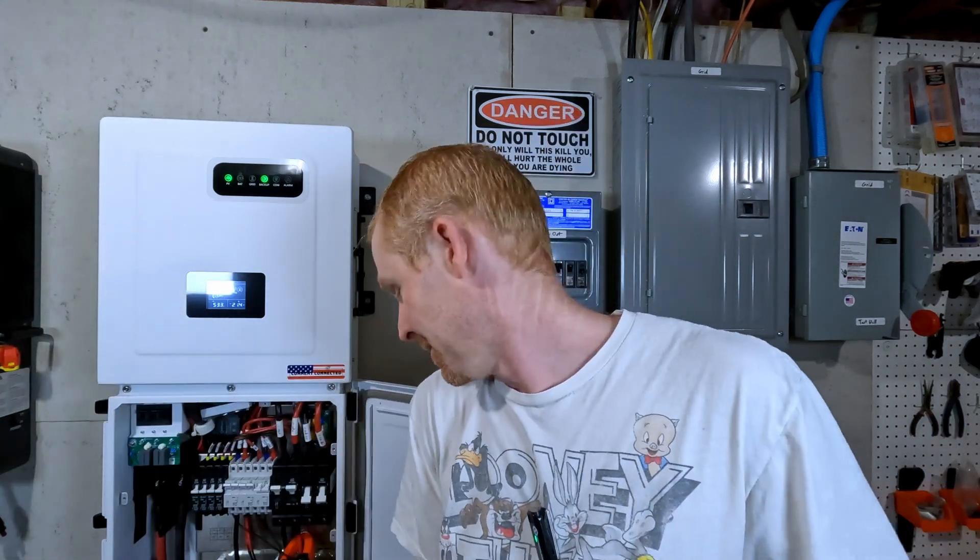I want to try and see how long it can run that way — 4 kilowatts versus a couple hundred watts on leg one. Everything else in the house is still running, so if a large load kicks on that might push it over the edge. But let's see if this can run for a minute or two with that imbalance between leg one and leg two. We're at 668 watts right now. 446 watts on leg two. Those bounce house blowers are going to be blowing cat hair and dust all over the basement. But hey, we've got to run the test. We've got the extra blower — let's use it.